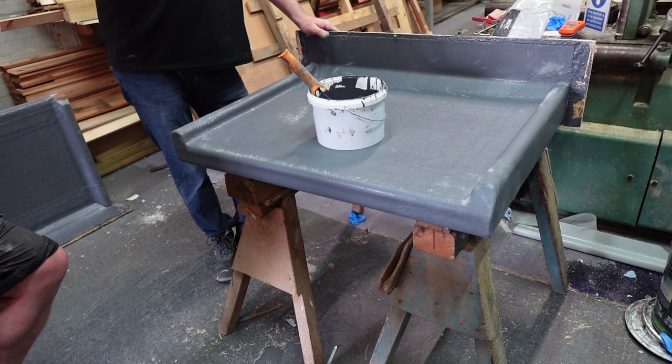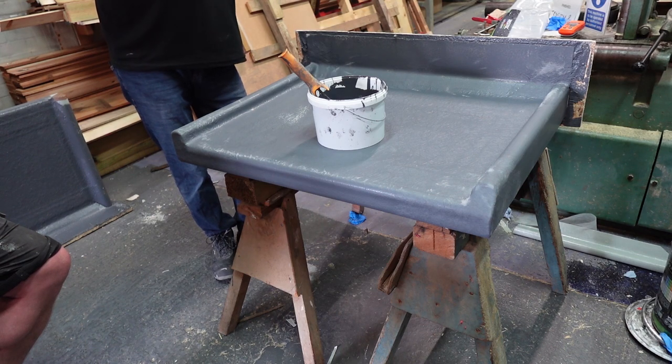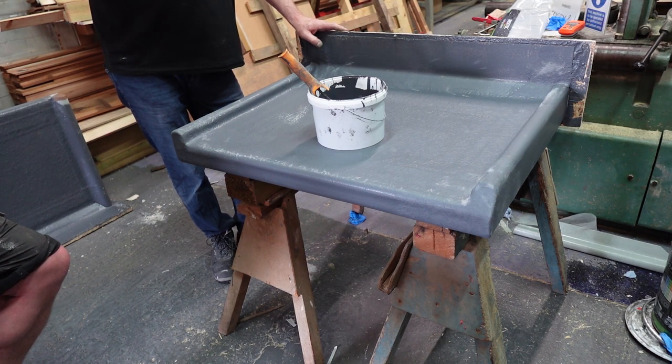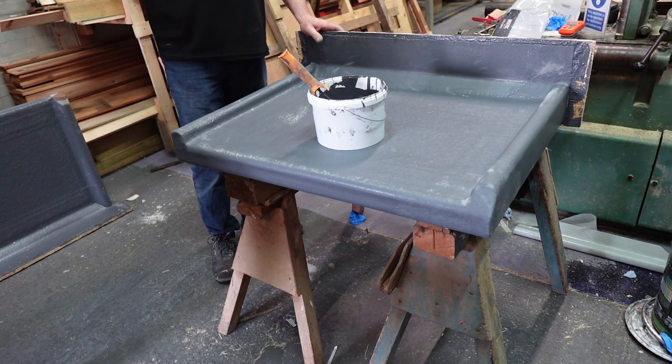It looks all right, but the base coat brings waxes to the top, and as soon as that heat gets onto that wax, it turns the wax back into gel, and it basically cracks up, and that's why your top layer starts flaking off. Most conventional roofs, if you go back to them, the base layer is not too bad, but the top layer is just flaking off.